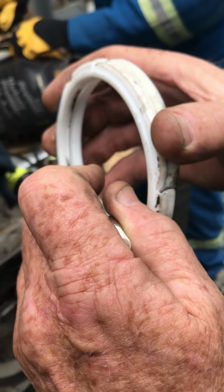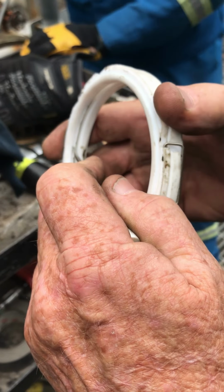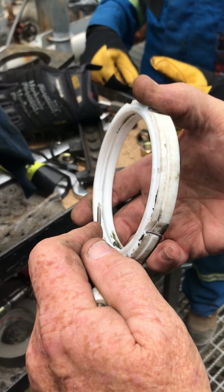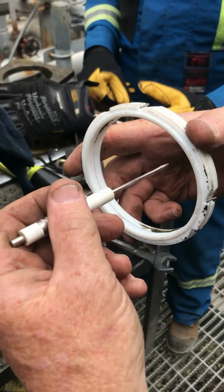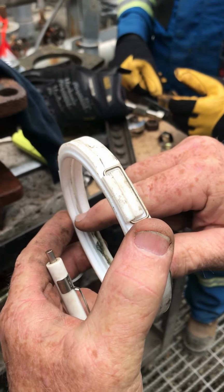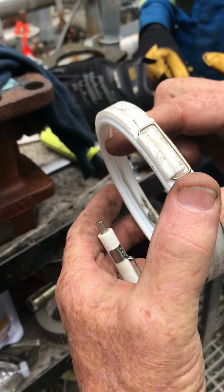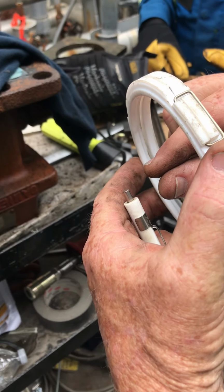And that's an energizing seal that you literally put the screwdriver in there like this without the plate in there, and you go around, you clean the stuff out of there, and it literally opens that gap again. So you energize it. That's why they call it energizing seal. And that's the seal for the OD of the plate. So when the pressure's going down through, it seals on the OD of the plate in the Teflon. So the gas can't go through here, and it can't go around here, but it can't go through the OD of the plate either. Okay? All it can do is go through the ID.